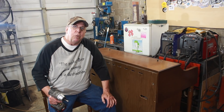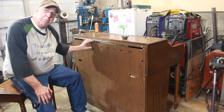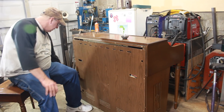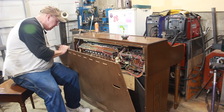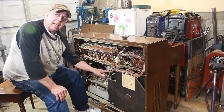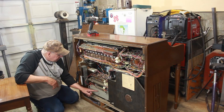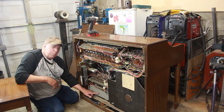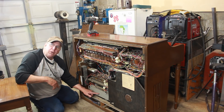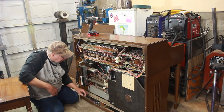We'll begin by opening the back and seeing what's inside. Judging by the fact that there are screws missing, I'm thinking somebody's been into it before. This thing here is a tremolo unit and that can be made into a separate instrument of its own also. Judging by the fact that this is suspended by felt, I would say that this is probably an analog reverb — which is nothing but a couple of springs inside with an input and an output.